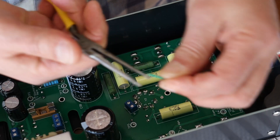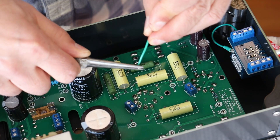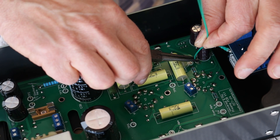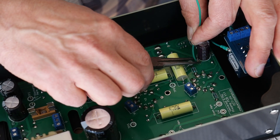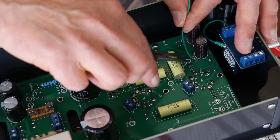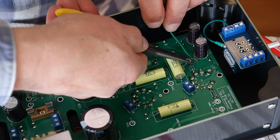Then we're going to come in here and bend that so it's up like this. Just drop it in there. We're going to come down and cinch that close. Just take your time. All we're trying to do is just pinch that conductor around the exposed lead here just to give it a bit more of a mechanical attachment, and it'll give it more surface area too.